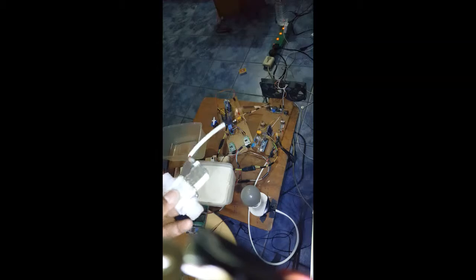Now, on the other hand, there's another empty bowl here, and it's for water, and we place it on the other one. If the water is finishing, the same process takes place. The only difference is there is a solenoid valve here. Now the solenoid valve is basically an electronic tap. If you connect one end to a tap using a hose, which I'll send in case you want to, and the other end into the bowl, it will block the tap from letting water into the bowl.